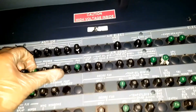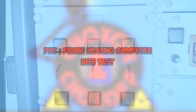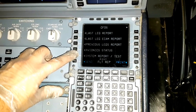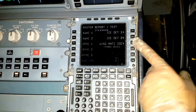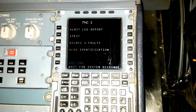We will normalize all 3 Pitot circuit breakers which we pulled before. Then we will do the BITE test as per the procedure. Make sure the ADIRU is in NAV position. On the MCDU, click on CFDS, then System Report and Test, then go to Chapter 30 Ice and Rain Protection — specifically PHC number 1 — and do the test. The same has to be repeated for PHC number 2 and PHC number 3.